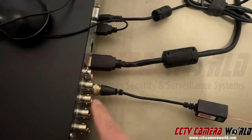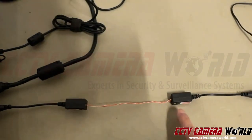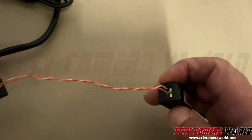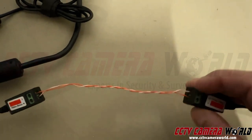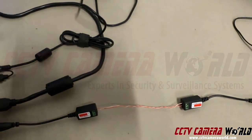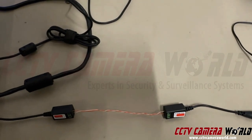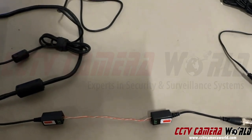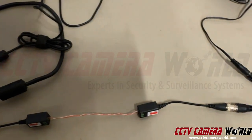Then you connect the other end again, matching solid wire to solid wire and stripe wire to stripe wire, positive or negative on this side as well, and plug it into your DVR — I'm connecting to the first channel. Make sure there's no excess wire showing through the connections, otherwise it'll short out and cause signal issues. Also make sure there are no breaks in your wire and use good quality solid copper. You could even run multiple signals through one Cat5e or Cat6 since there are four pairs — you only need one pair to send video up to four megapixel.